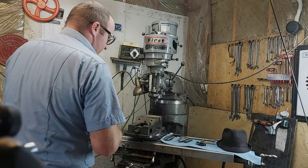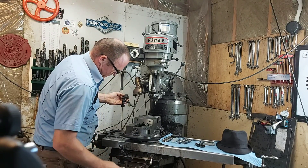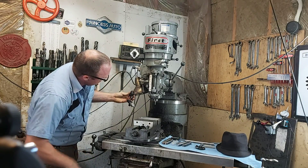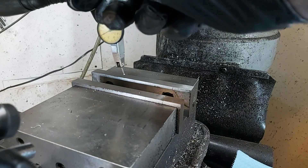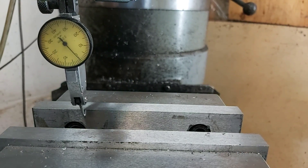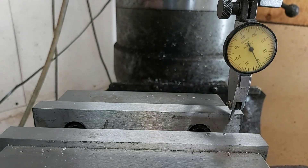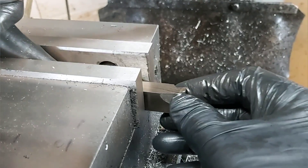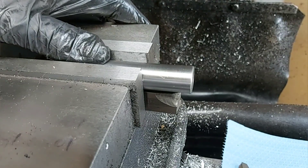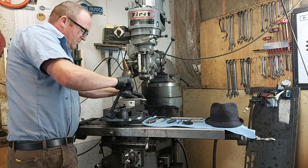Let's move over to the milling machine and I'll show you about cutting the keyway. Before we do anything on the milling machine, we want to make sure that the vise is parallel with the table. Even a couple thou out is going to bring heartbreak later on, especially when it comes to having a keyway on a shaft. For some strange reason, this finger dial is actually metric, so it's actually pretty accurate — you're going to see it move about a half a thou. I'm always confused when it comes to metric, but this is pretty much bang on. I don't have the correct parallel, so I'm going to use a piece of high speed steel. High speed steel is generally pretty close — within half of half a thousandth — so that'll be just fine for cutting this keyway.